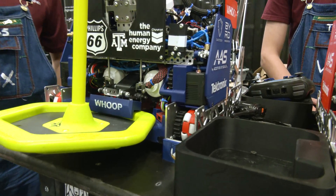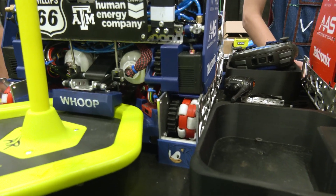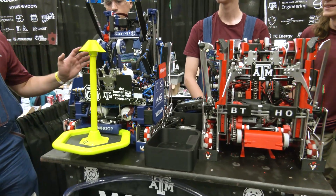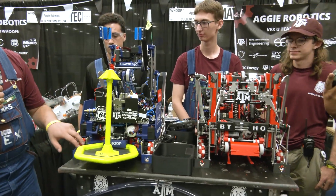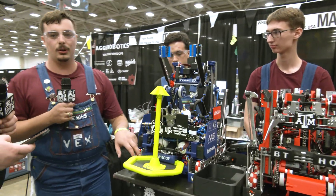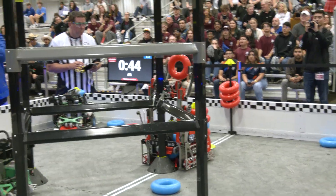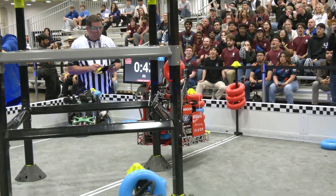I noticed on your gears — are these all 3D printed in-house, or what are they made out of? We have 100% 3D printed in-house. We have a sponsor, Additive at Scale and Safe Tech — we work out of their facility with tons of 3D printers. We use PLA for our wheels and TPU for the rollers. No problems at all with these custom Omni wheels — they look very professional level done.